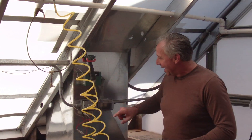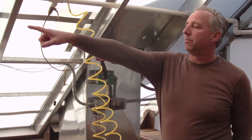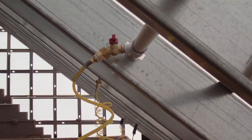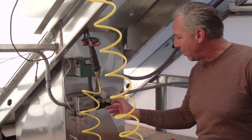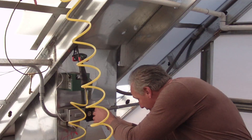The way we've wired this is we've run a switch on here for the thermostat. The switch turns on the transformer, and the transformer powers up the thermostat. You can see the probe in there — the thermostat reads that the earth is 61 degrees. When that got below the set point, it would trigger this control box, which would then power up this outlet. We have our water pump for the system plugged into this outlet. The water heater would have its own thermostat, set at about 120°F, and then this would turn the pump on and off as needed.